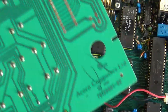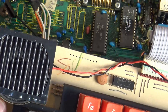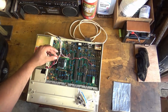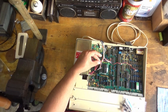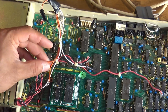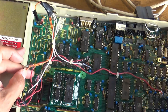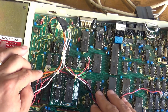Clearly this has been hacked about before at some point. There's a problem with the keyboard, or there was. And also the cabling in here for the plus five, minus five and zero volt supply side is an absolute nightmare with tape all over it - really quite shoddy. So we're going to have to get into that and rewire all of that. I can't believe there are even open connections hanging around on the board with no insulation on them. So let's spin this bad boy over and start pulling the power supply out of it.